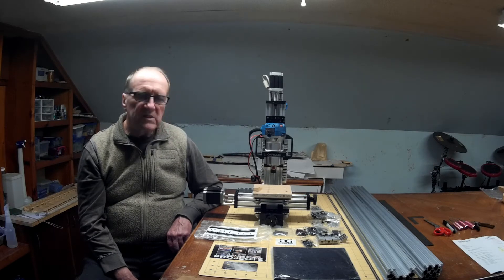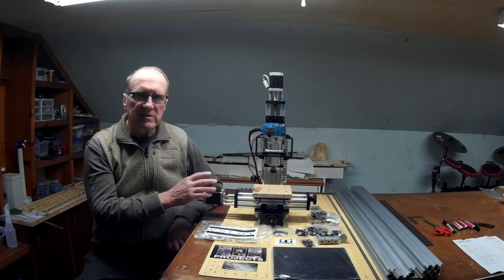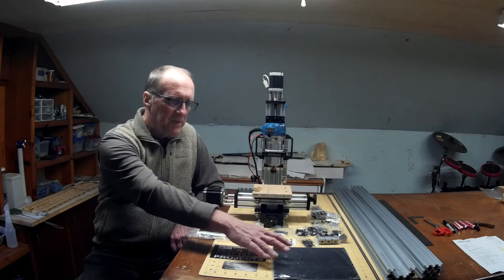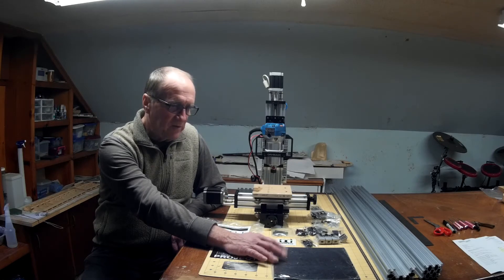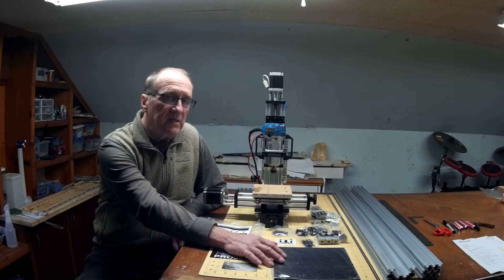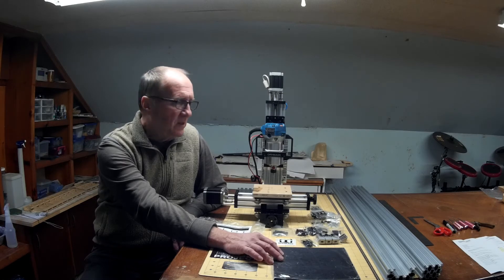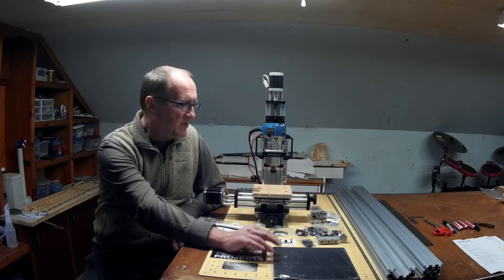The goal is to use as many parts as possible from the mini mill, having to buy as few parts as possible. I had some spare parts already — I actually had a build plate already that I was going to use on my 3D printer, but I ended up having one laser cut instead. So I'm going to use that build plate to start with. That'll give me about a 10 by 16 build area in the plans, and then I'll use that to cut a custom plate that'll take it to 10 by 21 or 22, and then with a cantilevered spoil board, 10 by 24 hopefully.